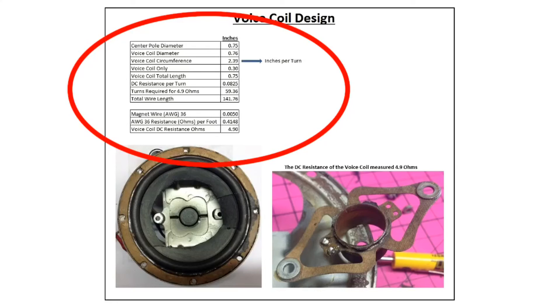I'll focus on the voice coil itself, figure out what material works best, and nail down the diameter to confirm whether it's exactly 0.75 inches or slightly above or below. I also have part of the spider left — I'll scan it to scale and try to reproduce it, doing mock-ups alongside the voice coil. I've ordered my magnet wire, and within a week or so I'll attempt the winding manually, which I know will be tedious and time consuming.